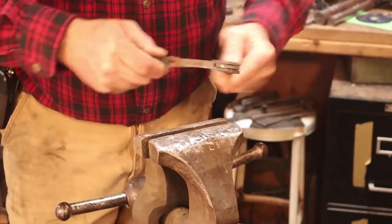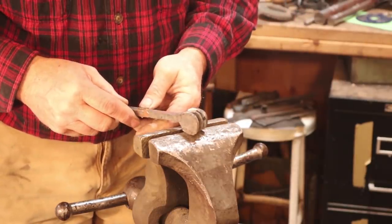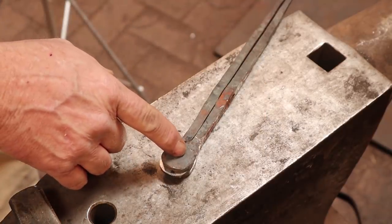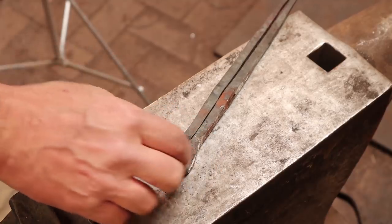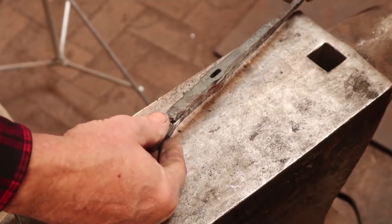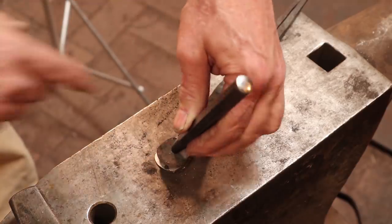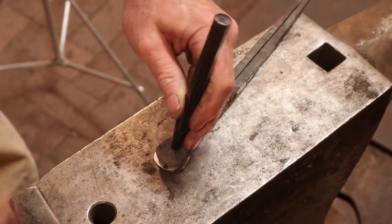I think those are getting close to a point where they will probably function well once they're riveted, heated, and worked. Then we'll finish rounding all that up. You want to decide what will be the center of the finished head — you notice this hangs over and it's going to have to be filed or ground off. Things aren't necessarily perfect. You want to line up your slots as much as possible because that does matter in the long run, more so than a lot of things. It's really important that it's in the center line with the joint, because that will show more than anything if you're off.